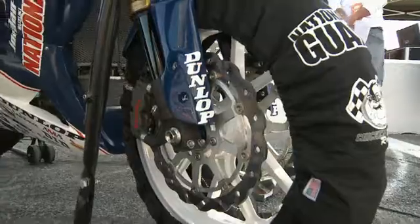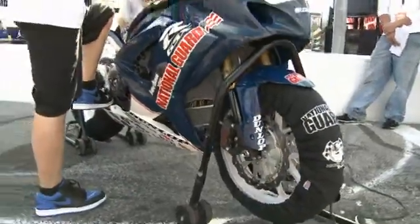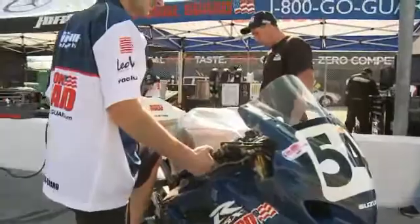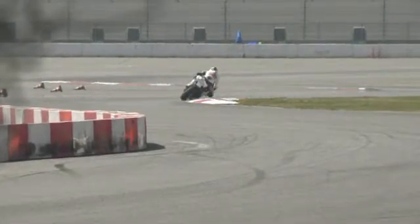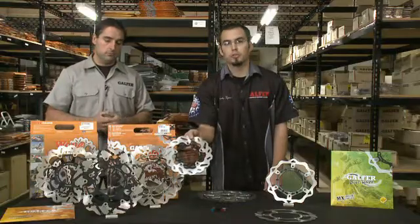When we do the grinding, there are different types of textures that you can use, and again, that depends on where the rotor is going to be used. If we go to the specifics of racing, depending sometimes on what kind of rider is going to be using that rotor, we can give it a more aggressive or less aggressive texture.